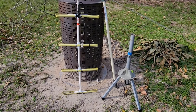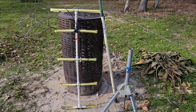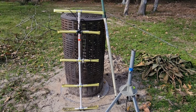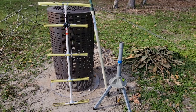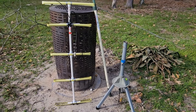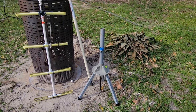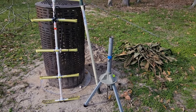Today I'm going to show you my home-brewed 2-meter Yagi antenna that I built a little over a year ago. I will link down in the description the blog from which I got the measurements. This is not a video to show you how to build it, but rather how to assemble a quick and easy, ready-to-go emergency communications antenna for the times that you may need it. What we've got here is a 2-meter Yagi tape measure antenna, a painter's pole, and a pole tripod — I believe it's for construction purposes — that I just had laying around, so we're going to put it to use today.